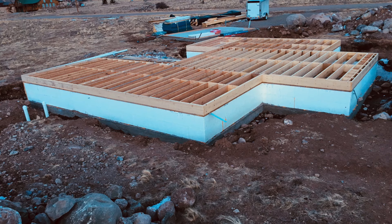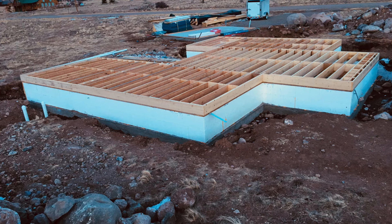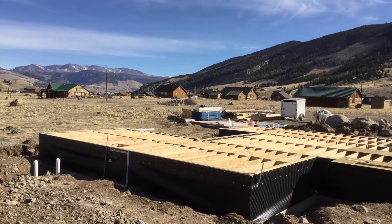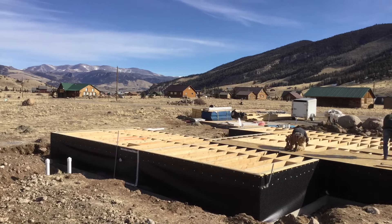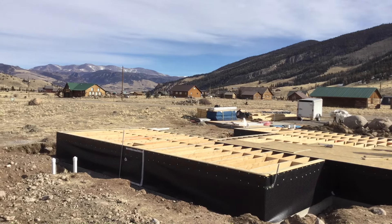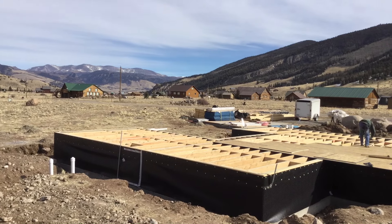You might be wondering why the scuttle hole is framed into the decking on the interior of the house — that's because this is an airtight house, and there are no penetrations into the crawl space on the outside. The biggest reason for me is snow: you'd have to dig out snow to get underneath there, and sometimes you won't be able to because it's five feet deep. We also put down a four-inch PVC in the crawl space for the return for the heat recovery ventilation, since we're about to close this thing up.